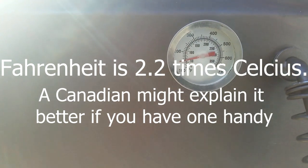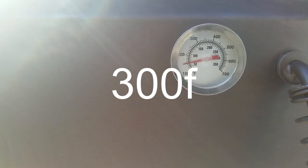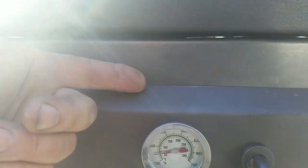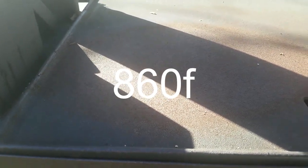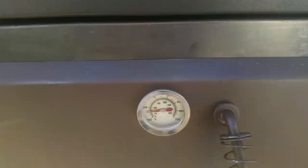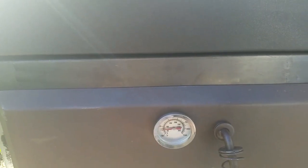This morning I'm getting it to just under 100 degrees Celsius — still nowhere near hot enough. I'm looking for 150, which is an average oven. It's just pleasantly warm here, but up there it's too hot to touch, and up there it's way too hot to touch. The crazy thing is I've got 400 degrees up here on the top plate, but on the plate underneath I've got 180 to 200 degrees Celsius. I've got to find a way of deflecting the heat down against the bottom to make the oven work.